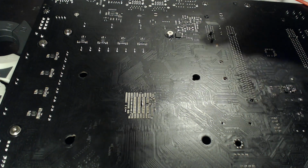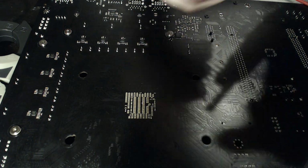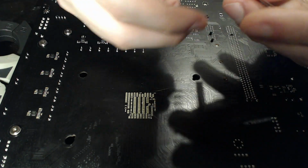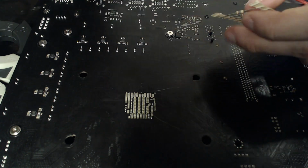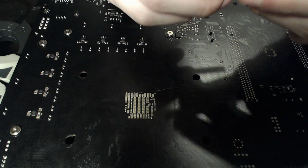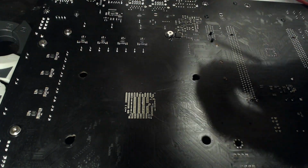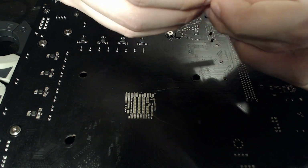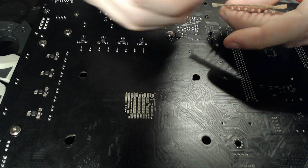So now let's get my 5K, which I put where? There. Also, if you're choosing resistors, you can actually use higher resistances. You can use 5K, 10K, anything in the thousands. If you go below 1,000, you're going to get more current. Just higher is sort of safer. It might skew your reading as well, but 5K works great for me, so that's what I'm going to go with.